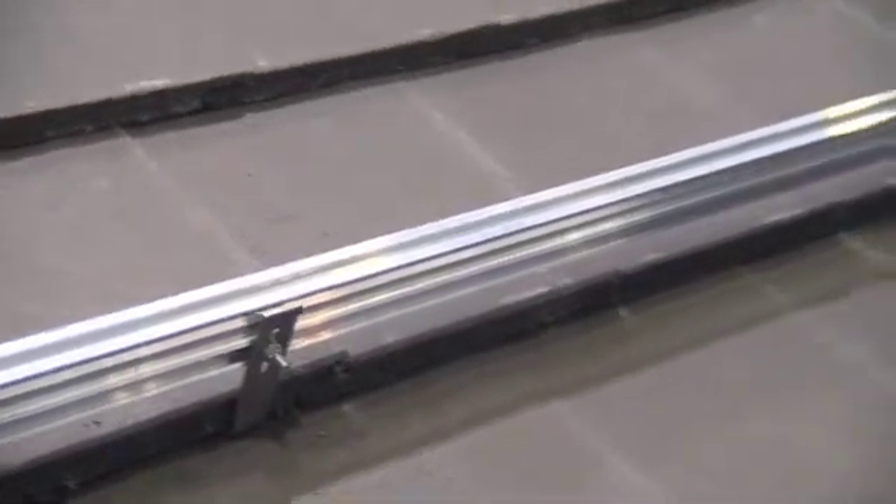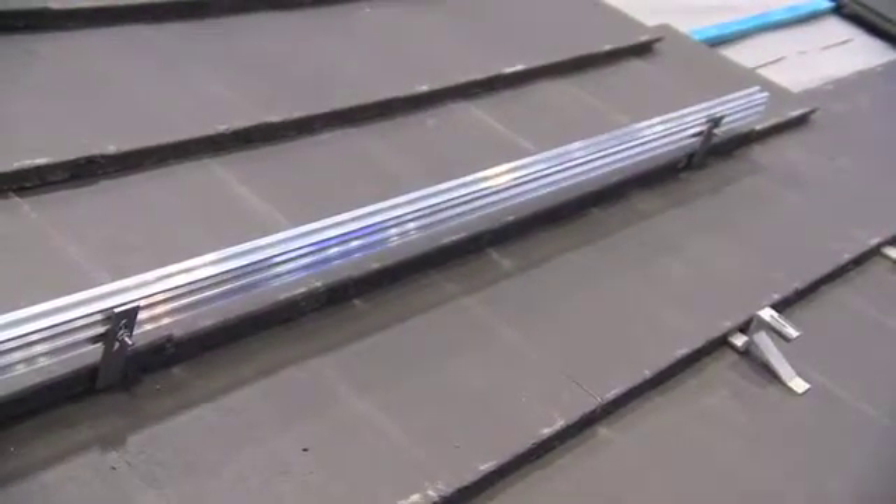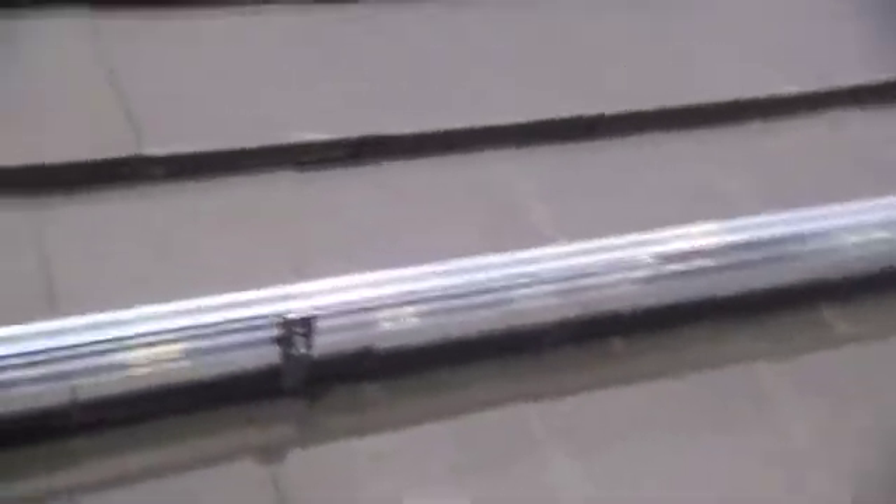When it comes to shading, this really raises the importance of using a mini optimizer, such as those from SolarEdge. With a standard string inverter setup you can get a thing called mismatch between modules. This can be caused by shading, but also natural occurrences — debris, leaves, bird droppings. Once one module on a string is affected, the whole system loses some efficiency. By using a mini optimizer on every single module, this completely eliminates that problem. It also gives you the opportunity to install modules where you normally wouldn't be able to on a roof, using maximum power point tracking technology.